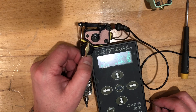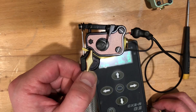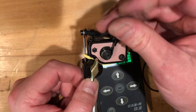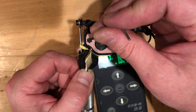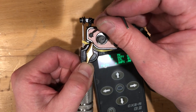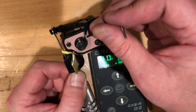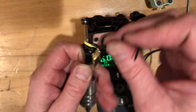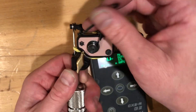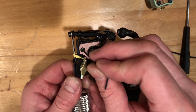The most important thing I'll go over is how to adjust the stroke. Back in August of 2020, I started putting little marks on the side plate and also an impact timing mark on the frame. I did this around the time I started putting the adjustable impact screw in, rather than just having the quick-set impact pin.